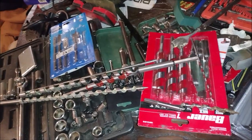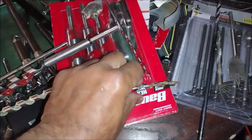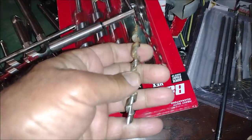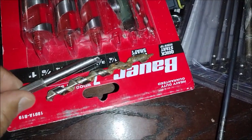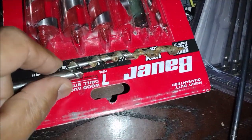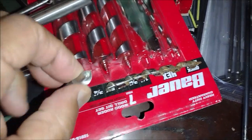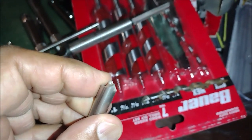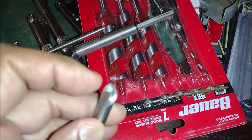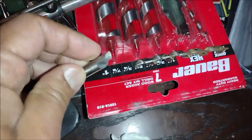When you are trying to do it by yourself without any kind of training, you make all kinds of mistakes. Here is an example. This is a broken drill bit for wood. Why did it break? Most problem, everything breaks because of overheating. You forget to cool it, the metal becomes hot in the center, you have a thermal gradient. It is hot in one point, it's cold in the other point. You have a stress and you have a break.